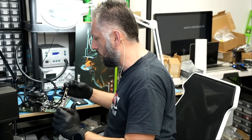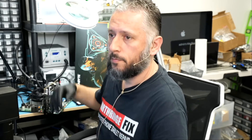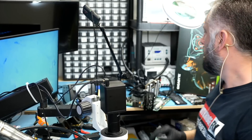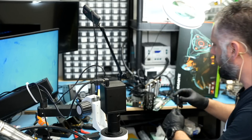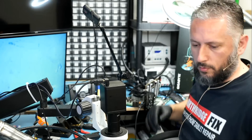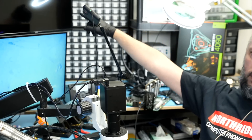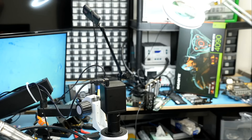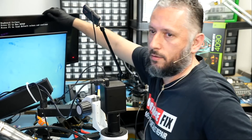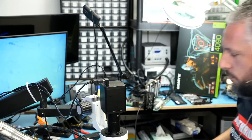Now we can quickly test the card. The cable is plugged in. Are you able to see this monitor? I do not have the HDMI cable plugged in — it's not going to wirelessly output the image. We have to run as far as we can because that's a 4090 — if something happens, it's going to burn this whole building down. Are we going to see a Dell logo on the screen? We should. Yes — we got it! Turn the video card off, we do not have a heat sink or fan on the video card, but a few seconds is no problem. That's it, we are done. We replaced the connector for the customer — a very common issue on the 4090s.